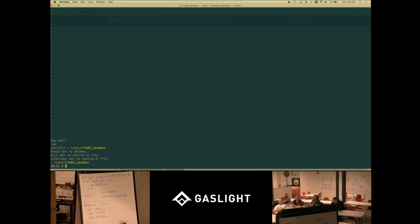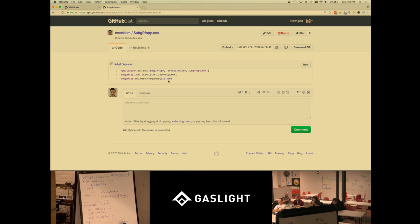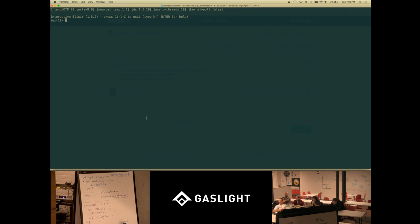You should have, if you're at the terminal, you should be able to type in screen and then /dev/tty.usb, and you should have a USB modem pop up on there. It'll have some random number. It could be 1413. It just depends. But on a Mac, they're all pretty consistent. Do you see anything like that? Yeah. Wait, which one? So, okay. It should be plugged into the OTG port already, so you should be okay with that part of it. Is it working for you or not working? If it's not working, it's probably my fault. Okay, that's exactly where you want to be.